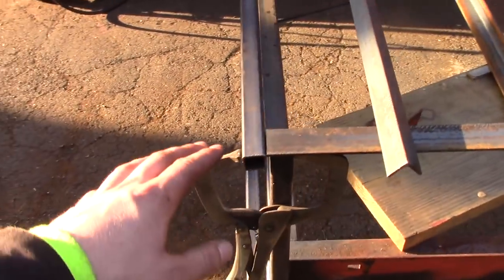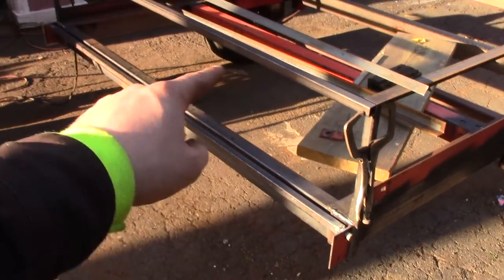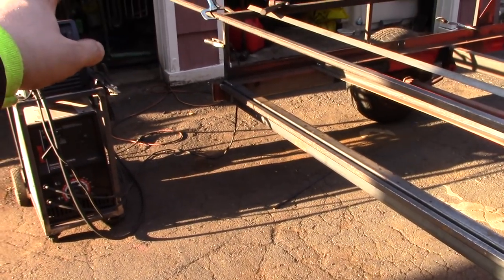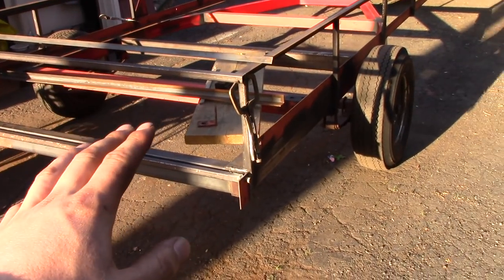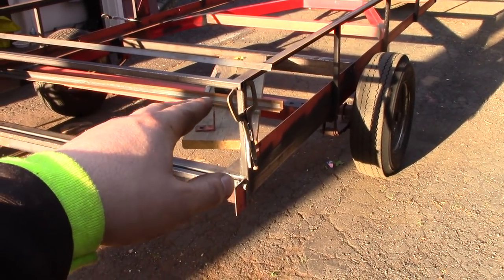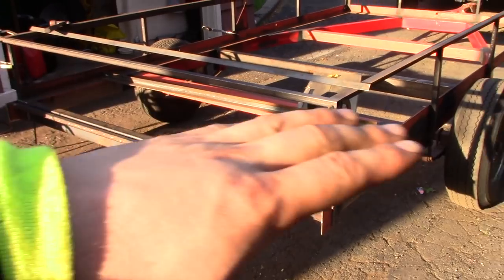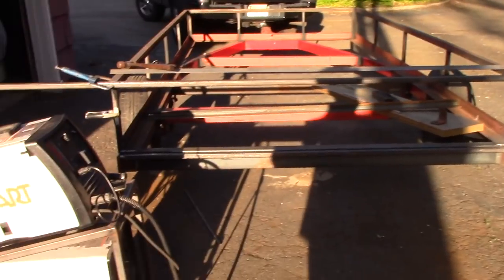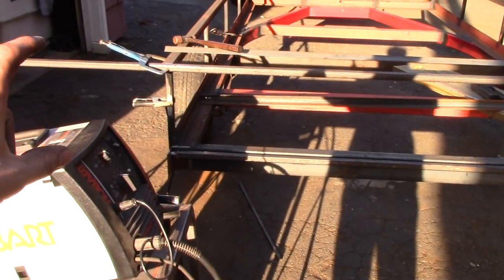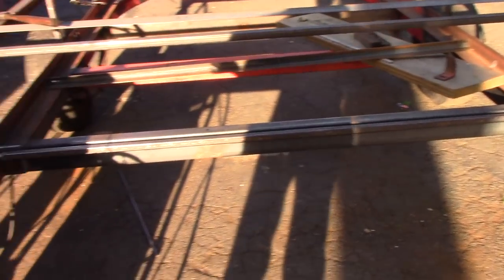I'm going to use one-inch square tube for the rest of this gate. I have this lined up where I want it, and now I'm going to cut out five sections of 12 and 7/8ths inch pieces of one-inch square tube. I'm going to tack weld them on there - the reason I'm tack welding like this is so that if one side's off by maybe an eighth of an inch, when I weld it all together the finish will look nice. I measured across the board and everything is measuring 12 and 7/8ths, so everything looks really good right now.